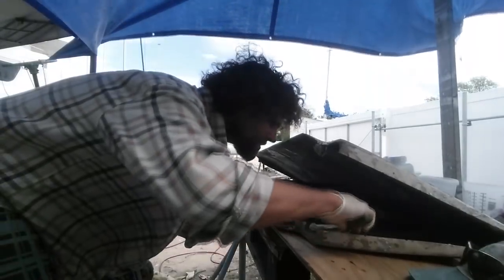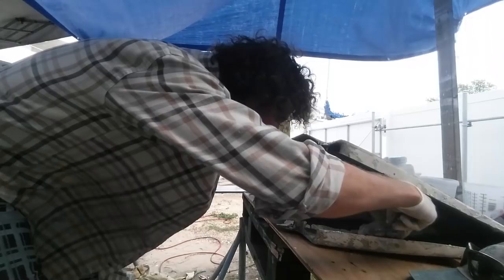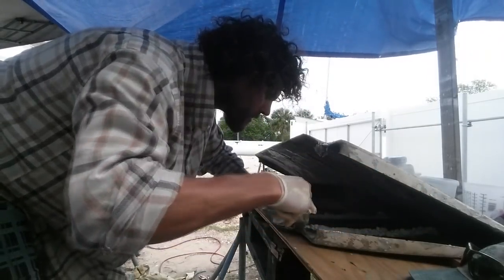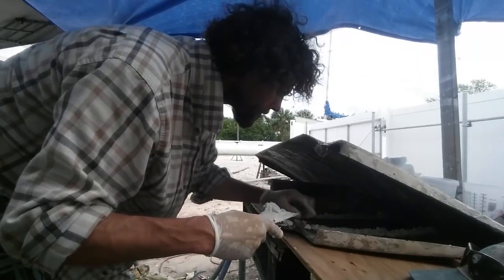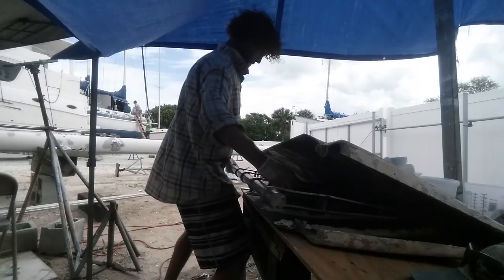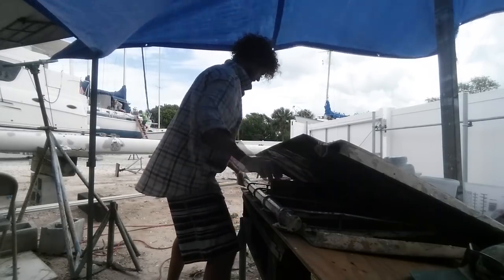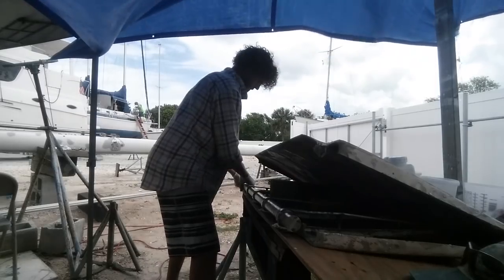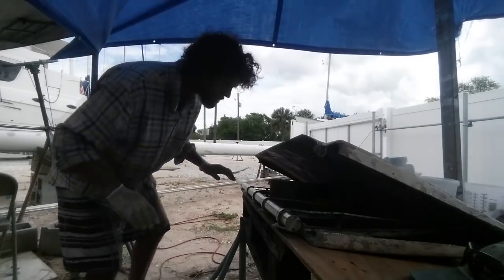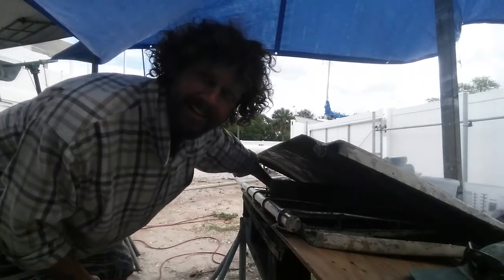I'm just about to put the stainless steel frame into the mould. So I've just got a mixture of polyester resin and Q-cells, about toothpaste consistency. So when the frame does go in, it'll fit the mould more snugly. I've got to get it right. It's about a 60-pound bulky frame and I've just got to get it in the right position. Here goes. Looking good. Well, that's got to be a first.